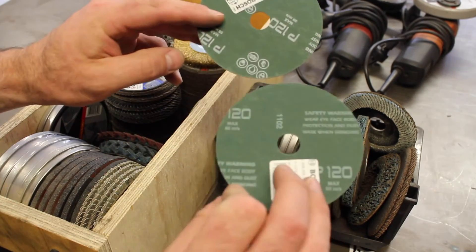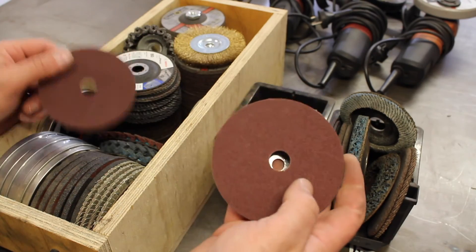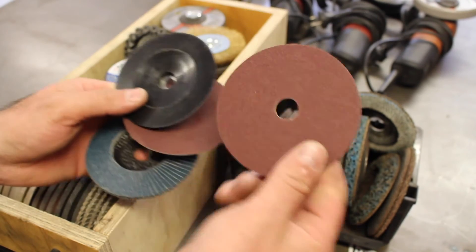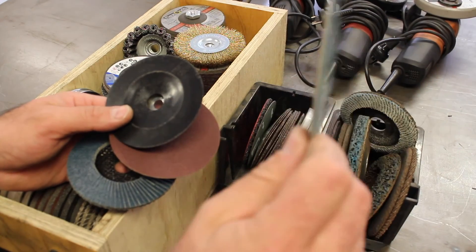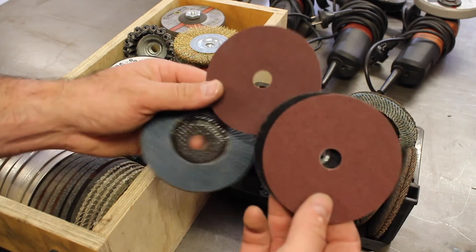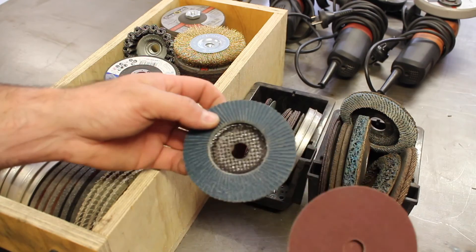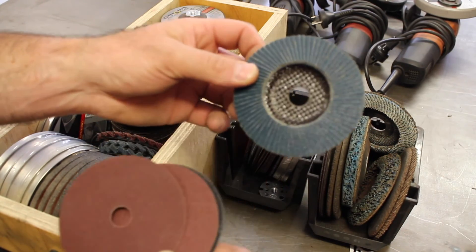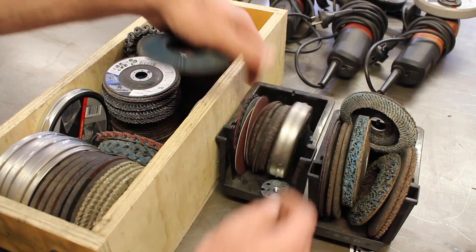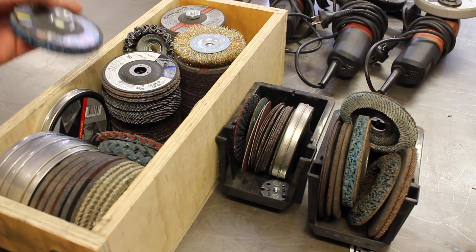Something I've been experimenting with recently is these sanding discs that need a backing plate. I was wondering whether they'd be cheaper than a Bosch flap disc — these are about 95 cents each, and the backing plate was five dollars. So if I could use more than seven of these per one flap disc, would they be equivalent? In my non-scientific experiment, the flap disc still wins — you remove far more material with it than with seven of the cheap discs. It was just an experiment; I'll use them up eventually, but the flap disc remains my favorite. I'll show these accessories in use in a future video on paint removal and metalworking operations.